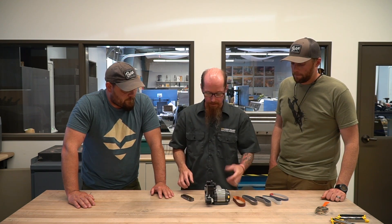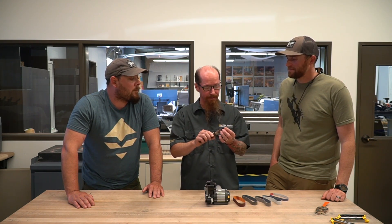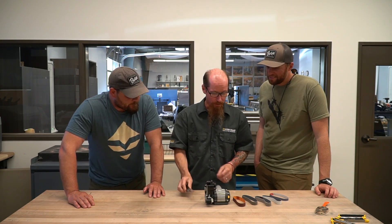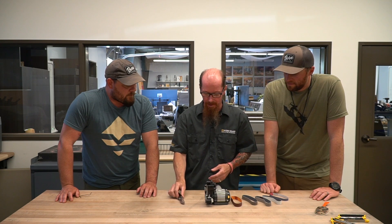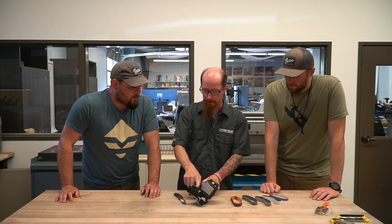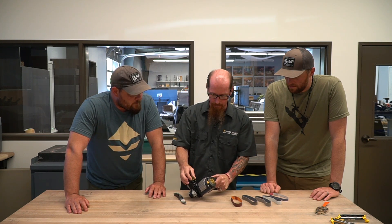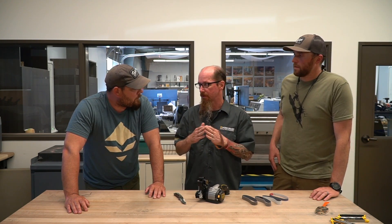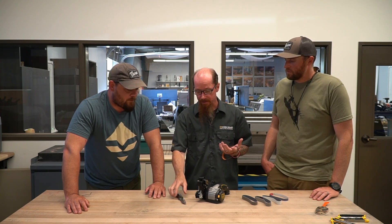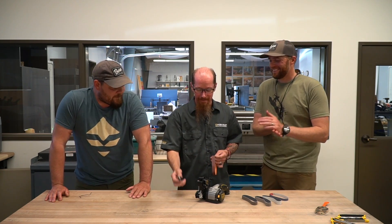Normally what we do first is evaluate the knife — see how dull it is, how much damage there is. It looks like it's been used pretty much as a screwdriver, so it's got a couple pretty decent-sized chips in there. I'm going to start with coarse grit, take a couple strokes, get rid of all those chips, then do a progression through the rest of the belts. This one is adjustable from 15 to 30 degrees just by turning the dial on the back side — you can see the different angles highlighted in yellow. I'm going to dial this knife up to 25 degrees. For outdoor knives, 25 degrees gives you a thicker bevel and a more durable edge. Higher-quality steel like S30V can actually hold a pretty thin edge, but cheaper steels just don't hold those thin angles.